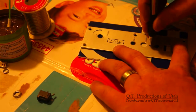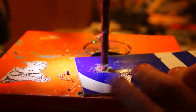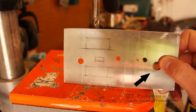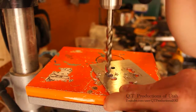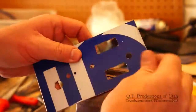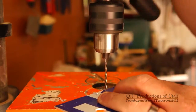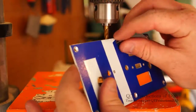I cut out a wider faceplate to accommodate the recent changes and center the old faceplate on top of it to trace the holes, omitting the ones for the red switch and power jack. I've drilled a hole for the charging jack off to one end and marked out where to put the two switches and the spare USB port. I drill several holes inside each rectangle and file them out to make rectangular holes, then use the old faceplate to mark the screw holes on each side and drill those out, using a larger bit to countersink each screw hole so the screws mount flush.